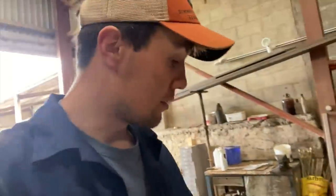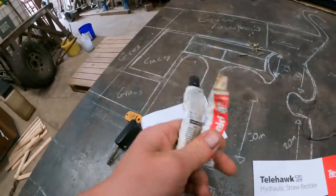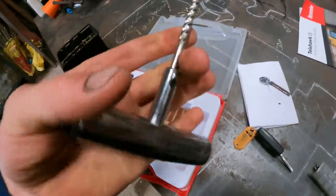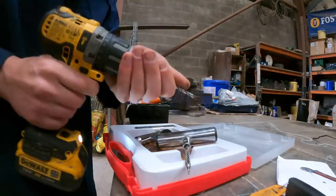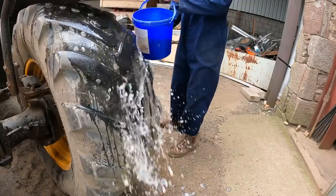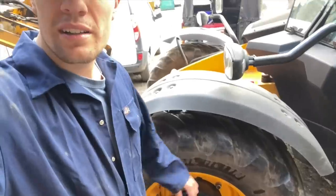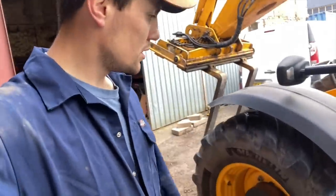The forklift has a nail in the tire so I'm just waiting to sort that out. Got some vehicle troubles this morning - got a key here that's falling apart, I've just fixed that with some JB Weld, two-part epoxy, really strong. This is a reamer and you're meant to, when you pull out the nail from a tire, use this in and out of the hole to kind of shape it and put it to that size. But it's really hard work doing that. I usually just do it with a drill, it's never failed yet. The nail wasn't penetrated through, wasn't leaking air. We've soaked it all in soapy water, soaked the valve, everything's fine. But it was definitely a bit soft, so pumped it up and see what happens now.